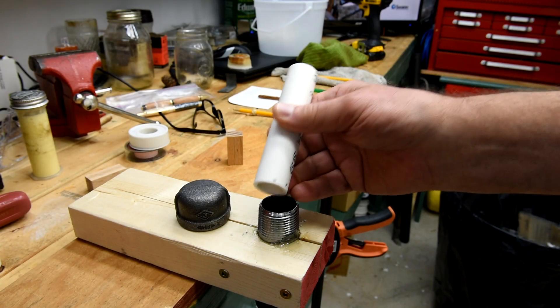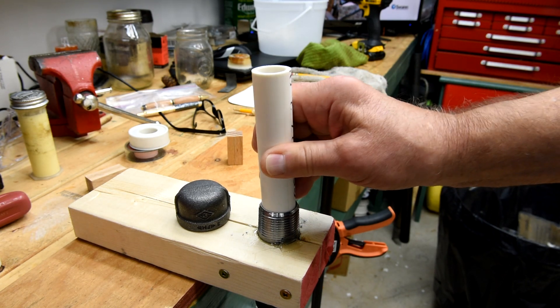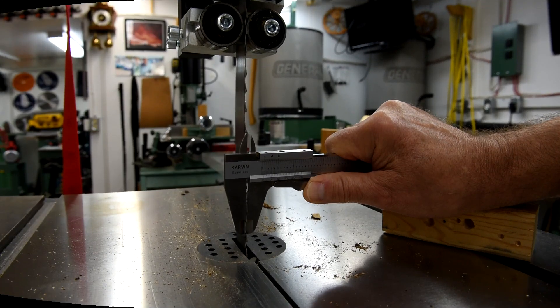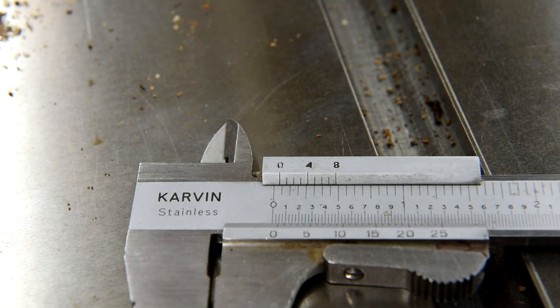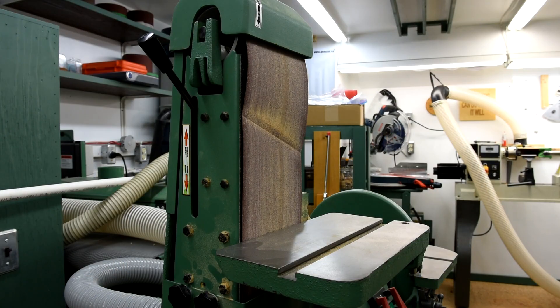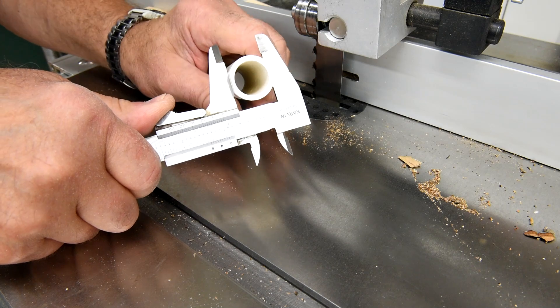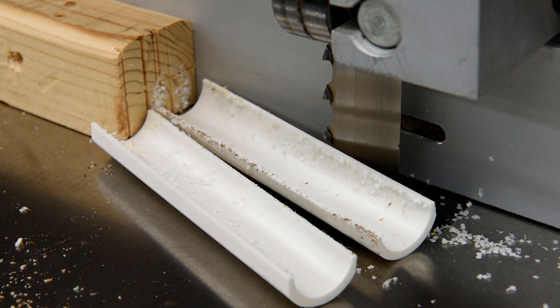I've discovered here that the outside diameter of the plastic pipe is pretty much the same as the inside diameter of the steel pipe. In other words, it's a pretty tight fit. And I could probably make it fit if I was to pound it in, but then I wouldn't be able to get it out. So the kerf on the bandsaw is almost a sixteenth of an inch, and that'll narrow it in one direction. And if I sand it down in the other direction and cut along that sanded area, well, it should fit.